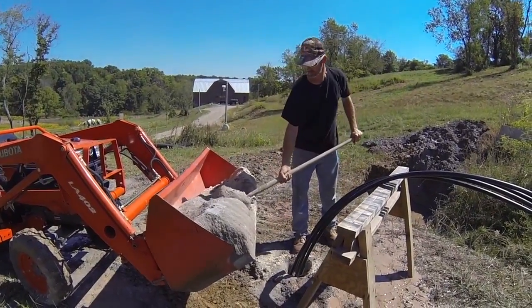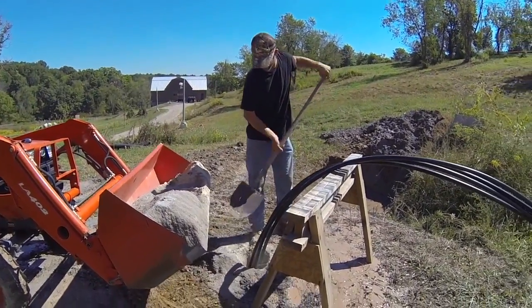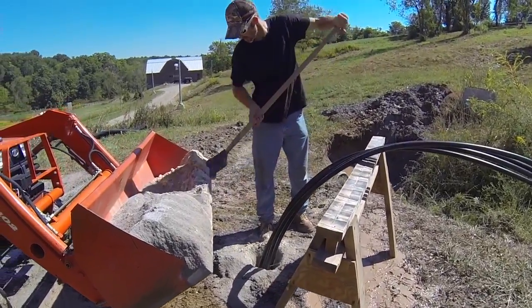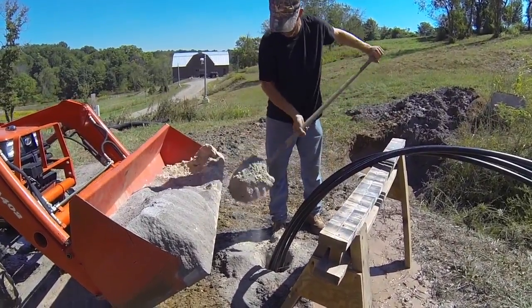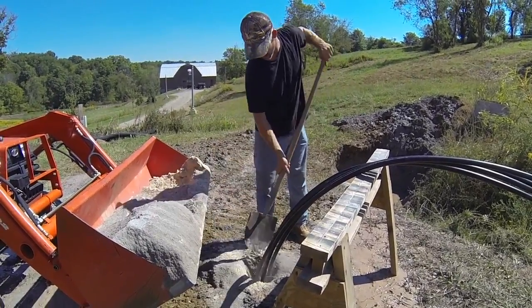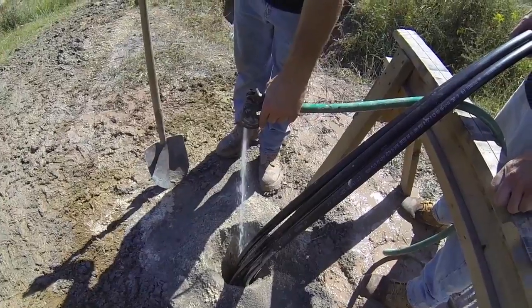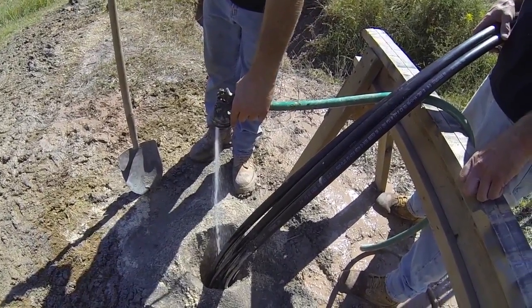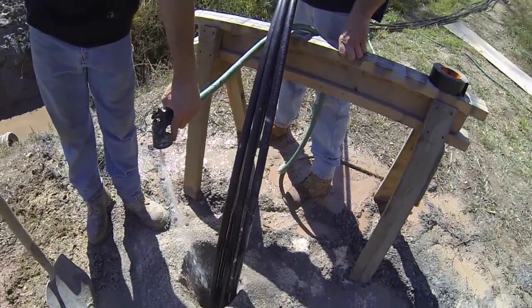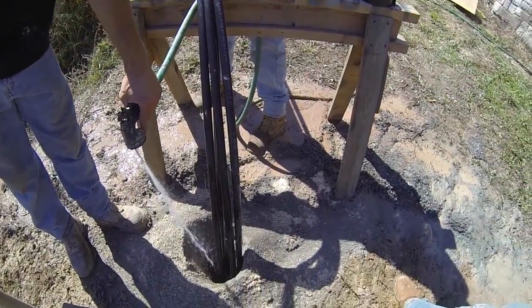The last step in the borehole installation is backfilling the hole with the sand limestone fill. This method was chosen over using thermally enhanced grout because of ease of installation, lower cost, and better thermal performance. As always, bentonite is used to seal the surface water from entering the groundwater table at the surface of the bore.